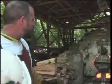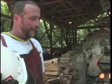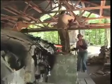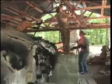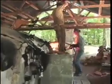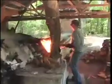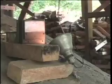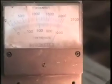So right now we're doing side stoking and firebox stoking to try to modulate the heat and to build a coal bed in the back of the kiln. And it's tricky because sometimes the temperature goes down when you do that. You'd think it would go up, and that's not always the case. So it looks good right now. It looks like we're achieving what we wanted to do. Well, how have things been going? Any problems or anything over the firing?